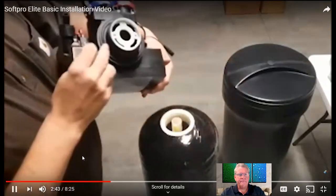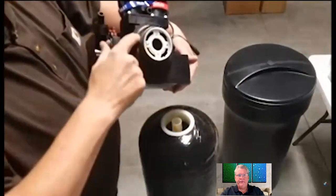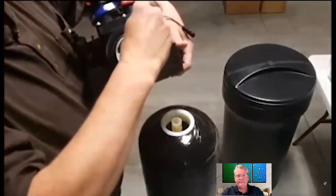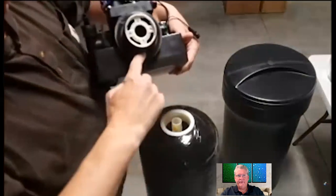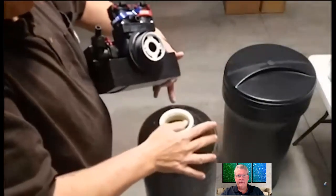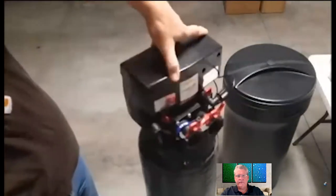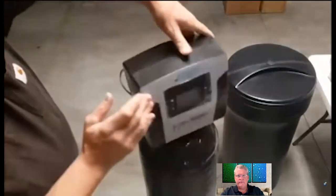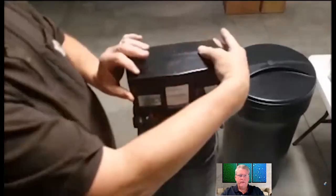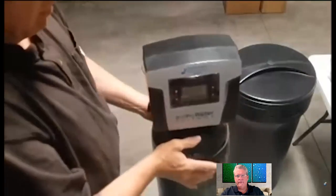Inside the box comes a little bit of lube, and you'll see an O-ring that goes around here. Take some of the lube — use protective gloves — and lube this O-ring well around the outside. The reason is it'll make a good seal and if you ever have to take it apart it'll be easier. Now wiggle the tank just a little bit to get the tube into the center, then put the control head down on top and secure it. It turns on pretty easily — nice and tight but don't over-tighten it. Our control head is now mounted.